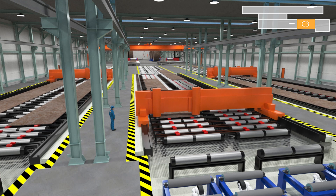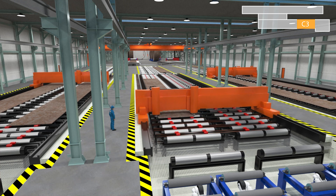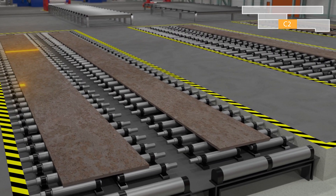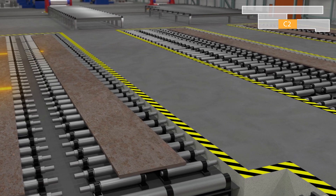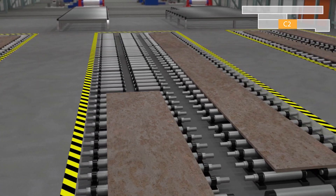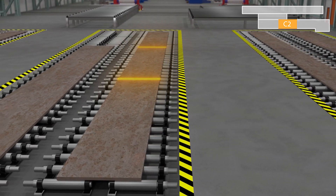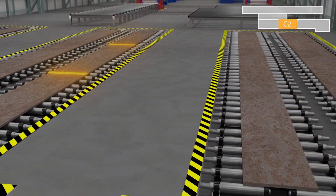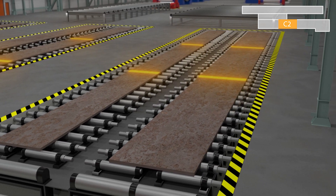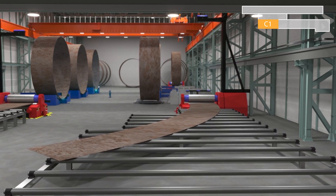As you can see, the machines can mill the long sides simultaneously. In Hall C, we will also check for welding inaccuracies. Doing this now means that we have a very short feedback loop and we can immediately adjust our process to prevent these anomalies. Repairs to the plates will be done offline after the process in this hall is completed, securing the logistics flow.